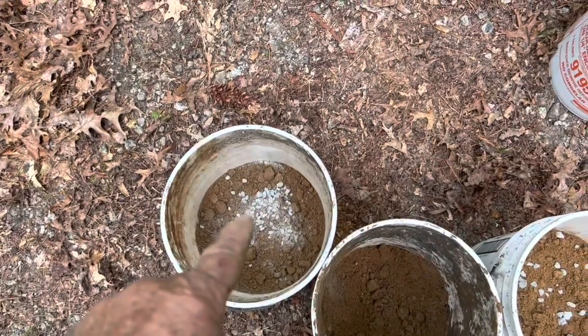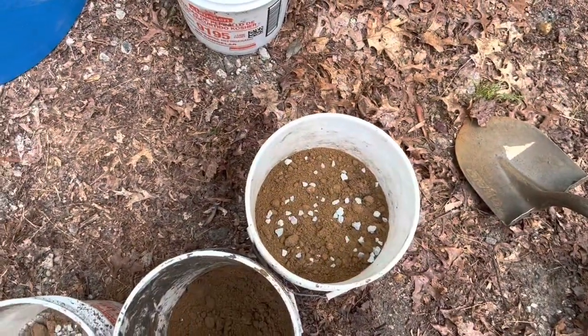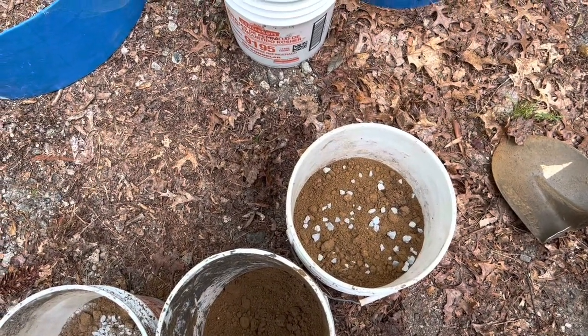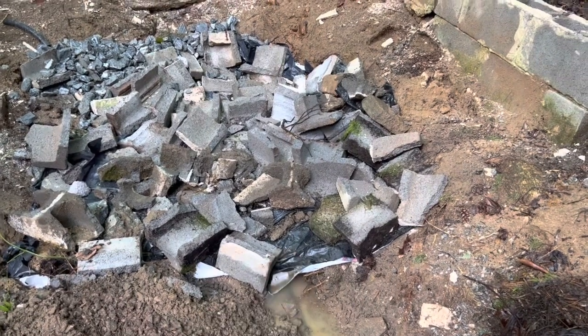What I've done is put a little bit of dirt and bentonite clay in layers. I'll mix that up. I've got two buckets about half full of clay and bentonite, and we're going to go down here and pack this dam wall in now. We covered it with some fabric for strength and plastic on top.